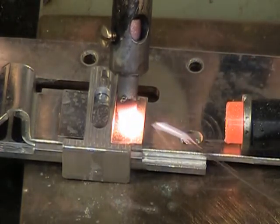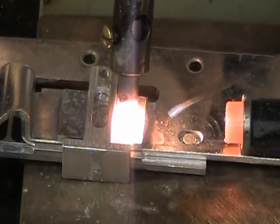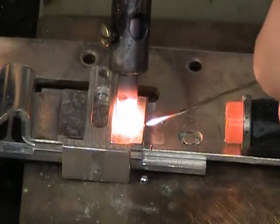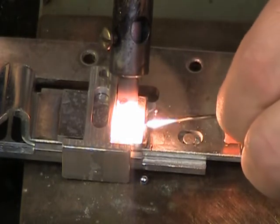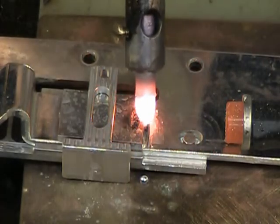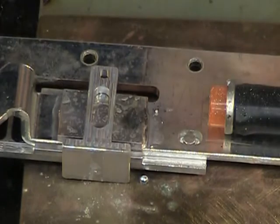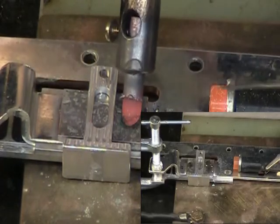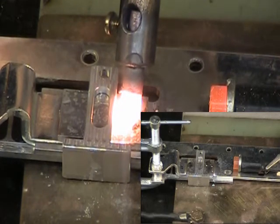You can kind of see that flux activated a little bit down below there. Now what's going to happen — I can start to flow the solder on that top plate, but I want the heat to transfer all the way down to that bottom plate so I get good wetting down there as well. And Virgil, you must have a return somewhere on the fixture? Yes, I do. This clamp, as you see it over here, is the return for current flow. It's off to the left of the screen, you cannot see it right now.